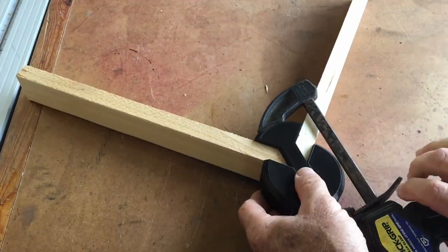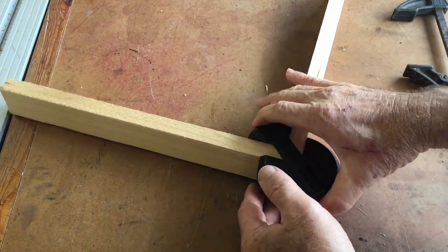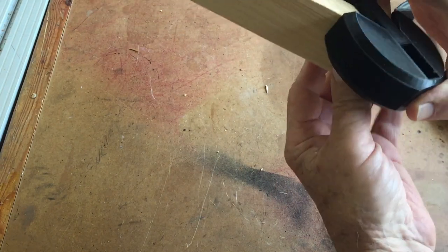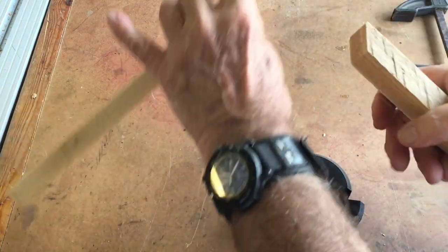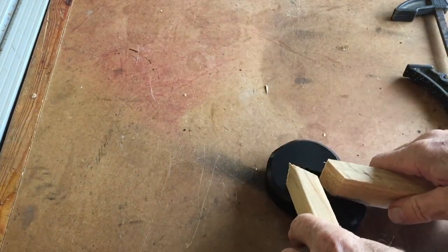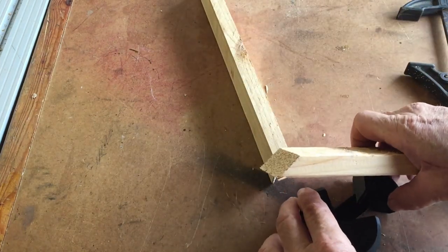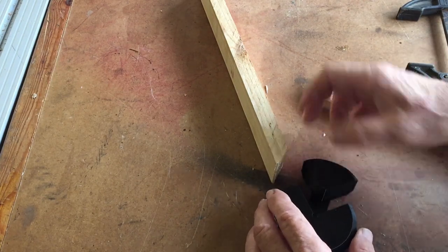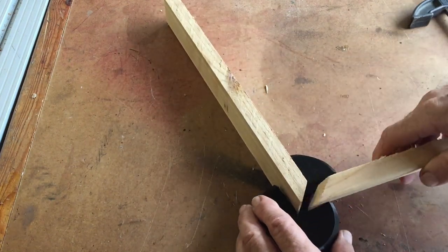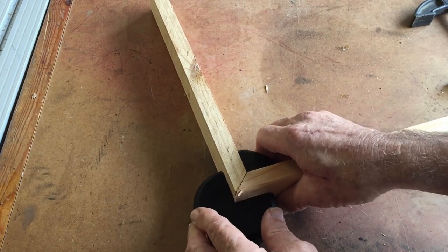I like this particular unit, and I'll show you why — you can still drive a brad nail or screws, you've got glue, and it doesn't take up a lot of space. The other thing you can do if you're trying to fit your 90 together is you could flip it upside down and bring your lumber in. You flip it upside down and you can bring your pieces of lumber in like this so you can make sure they're coming together.